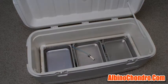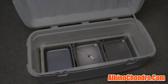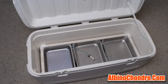The air line is connected to an air stone and secured in the center pan. The air stone and the air line both serve to introduce fresh air into the system, which I think is something that has been conspicuously absent from most incubator designs. But it also serves to atomize the water in the center pan and push the ambient humidity inside the incubator those last critical percentage points to total saturation.